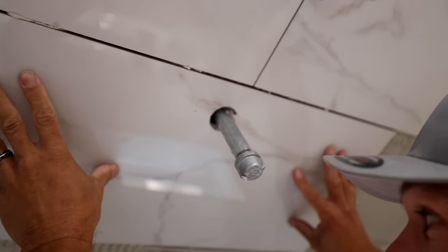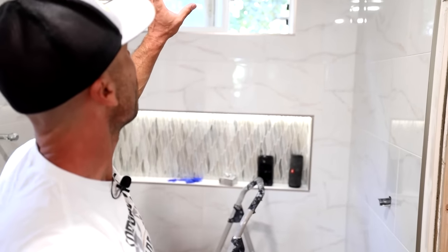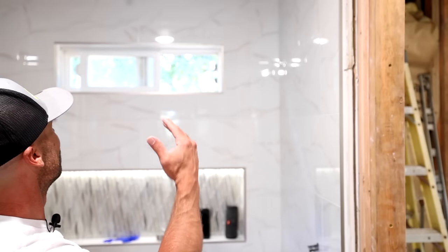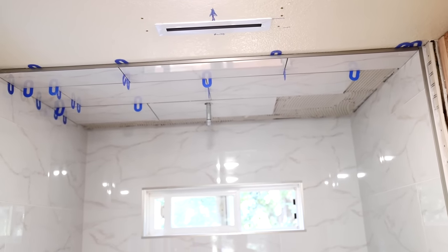This is Schluter Allset. It might be good to get out of the way, hold it, and just keep an eye on it. What happened was Kirk set a couple tiles — they stuck with the Multimax Light. He went out to make a cut, boom one fell, then another one fell and hit him right in the cheek. Luckily that's all it did, because one of these tiles weighs about 10 pounds. Porcelain tile is sharp — if that comes down on you, you could be in big trouble.